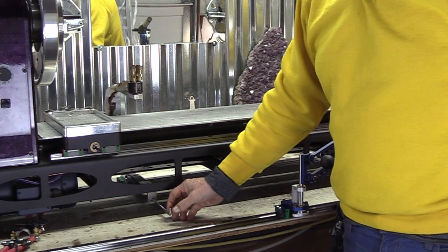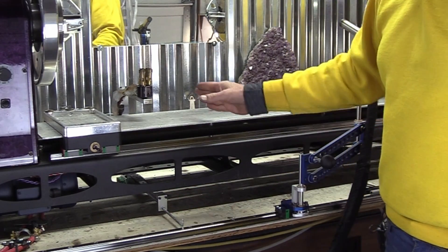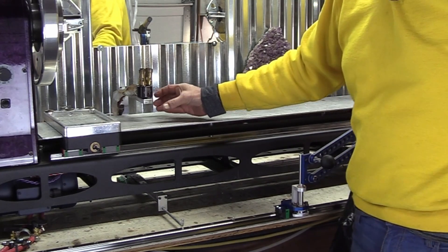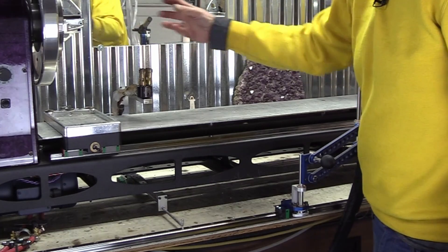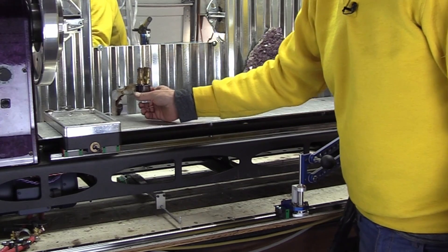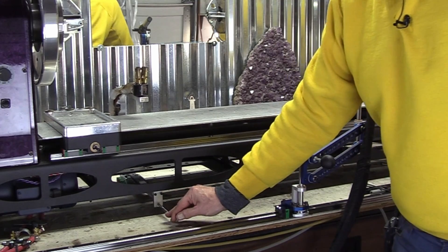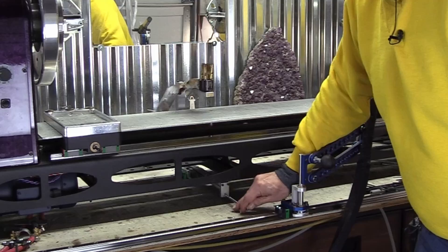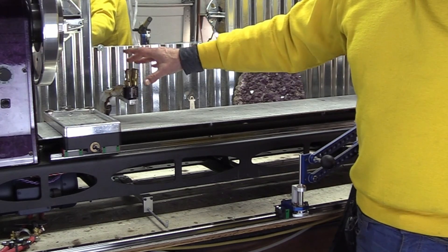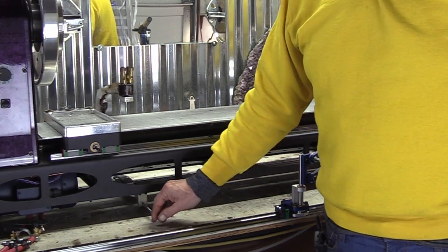I also have another prototype I'm working on. Traditional Bunsen mounts — like Herbert Arnold and the scientific and various other Bunsen mounts — require you to reach into the hot zone; you have to reach under the hot glass, the Bunsen itself gets hot, and you have to reach into the hot zone to move it around. The idea here is a little lever with a hook down in the cold area, so you can move the Bunsen around without getting into the heat zone. This is a far earlier prototype, not nearly as mature as the Torch Armadillo, but it shows great promise and development continues.